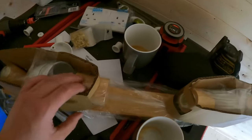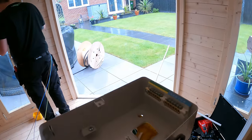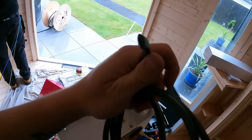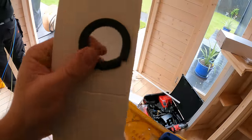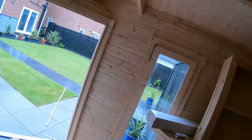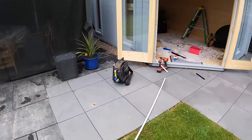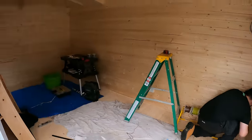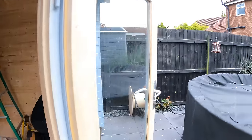This is the light fitting we're using - it's a wooden one so it suits the summer house, going to look really nice. Ryan's finishing off the lights. I've put some grommet strip - couldn't find a 40mm bush in the van. It's the good stuff, metal-lined inside so it holds its shape. That's going to go up to the side basically. That's us done for today - come to a bit of a standstill. All second-fixed inside except the board. We're just finishing that last socket. Lights are in - a bit of conduit on show but not a lot.